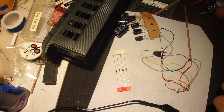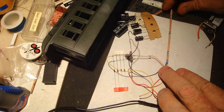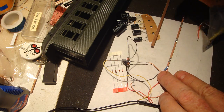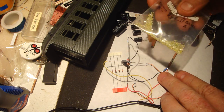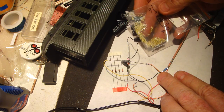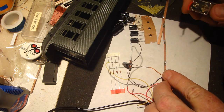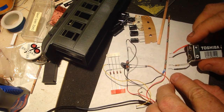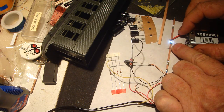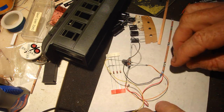Here's stay-alive capacitor lighting. I've got a circuit board here — I cut three slots in it to fit these surface mount LEDs. These are 0603 warm whites. You don't need to buy an expensive LED tester; you can just make one out of a battery. I can test each LED as I go.